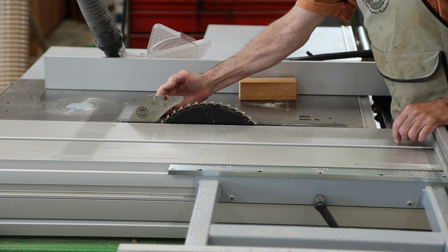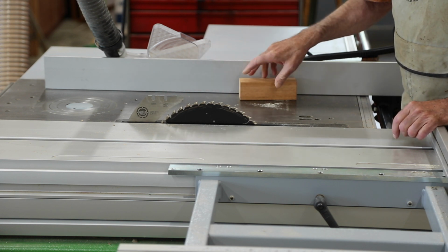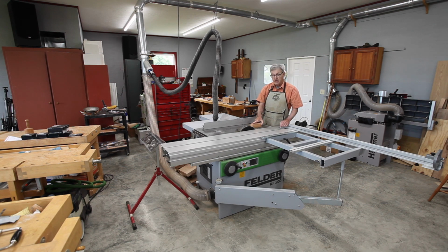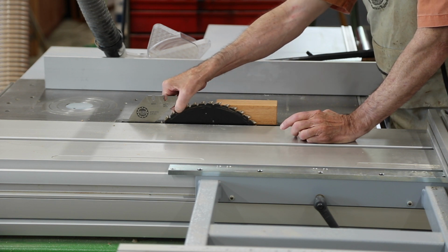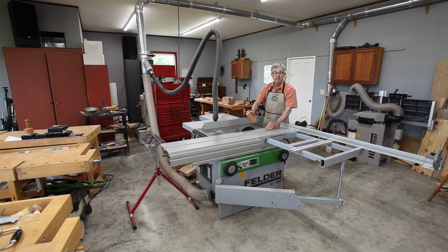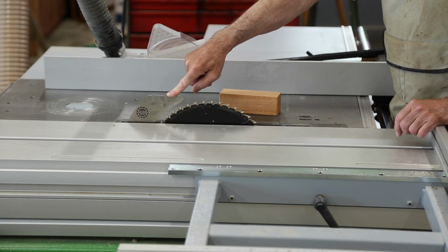They come with your saw and they ride just behind the blade, and they're a little bit thicker than the blade. When you rip a piece of wood, it can do three different things. It can spread apart like a banana, it can stay the same, or it can pinch, leaving you cutting here and it pinching back here, which throws it up. It rides across the top of the blade, and a kickback, which can do serious injury, is the result. It can also drag your hand in odd directions. So the addition of a splitter is really, really important.